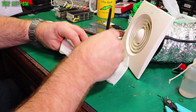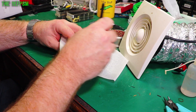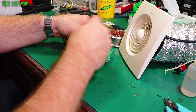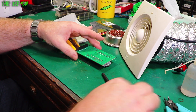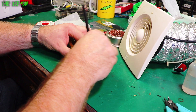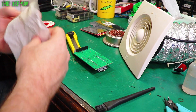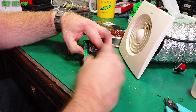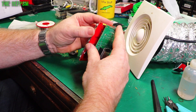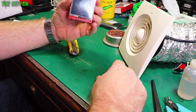I'll use a scrub to get rid of the worst of the flux, then use a tissue to soak up the rest. Not too bad — there's still some residue because I use such a hot iron and the flux burns a little bit. Technically I don't really need to clean the flux off, I just like to do it. With the cleaning done, there's not much left — we've got to plug the screen in, put the standoffs in, then power it and program it. It's a pretty easy project.